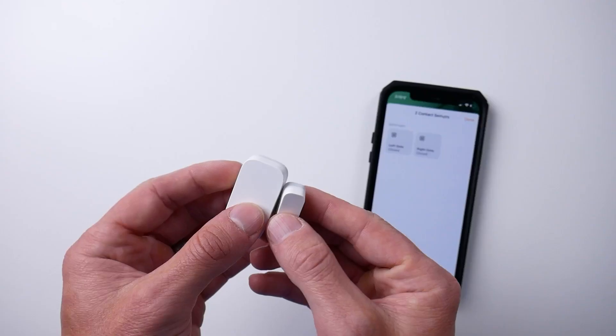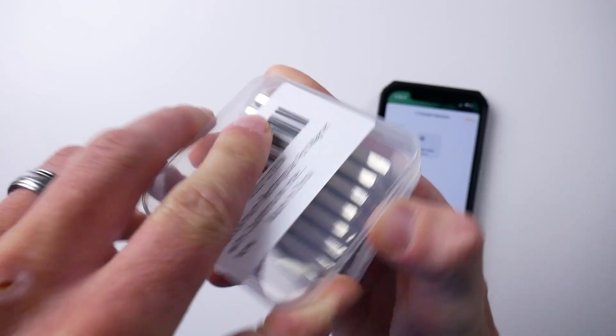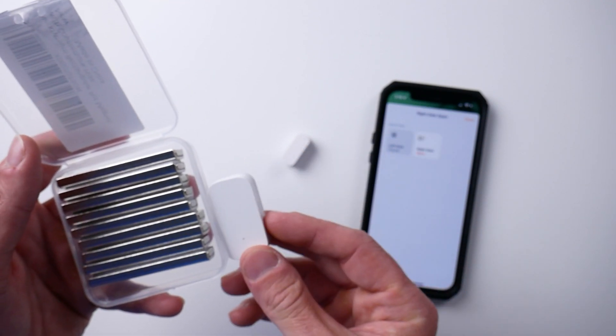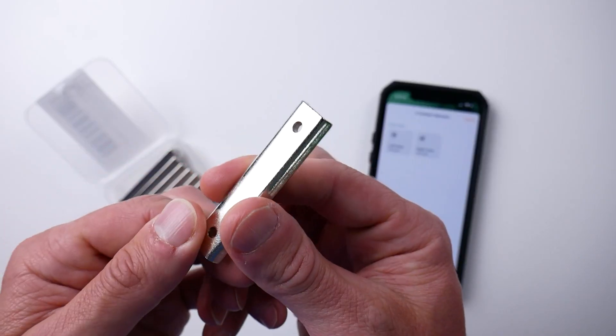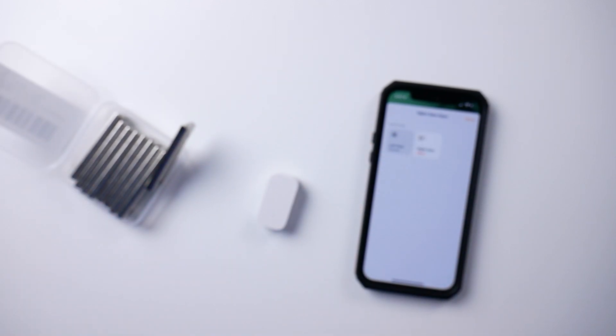Let's look at everything we'll need to accomplish this today. Of course, we need our door sensor — I'm using the Aqara one. I do recommend these, but you can use any HomeKit door sensor as long as you can get a good connection to wherever you're installing it. Then I got this pack of really strong rare earth magnets from Amazon. As you can see, these can trigger the sensor. The small part on pretty much all door sensors is really just a magnet, so you can replace that small piece with any good magnet. A 10-pack of these costs about $23. I'll put links to everything down in the description. These are really strong, they have little mounting holes on them, so they are perfect for something like a wood fence.